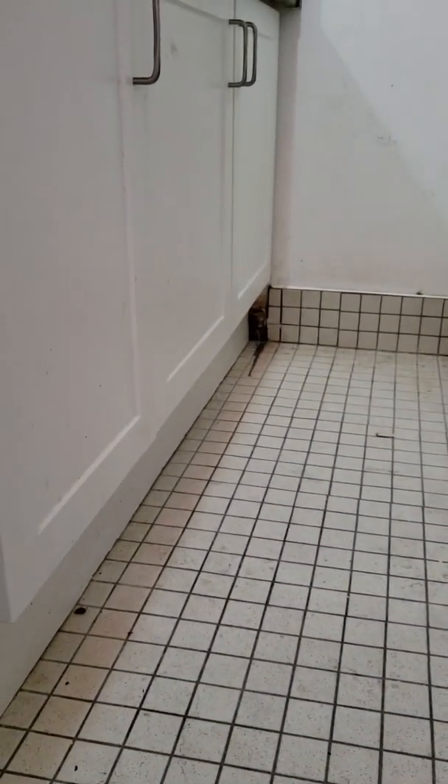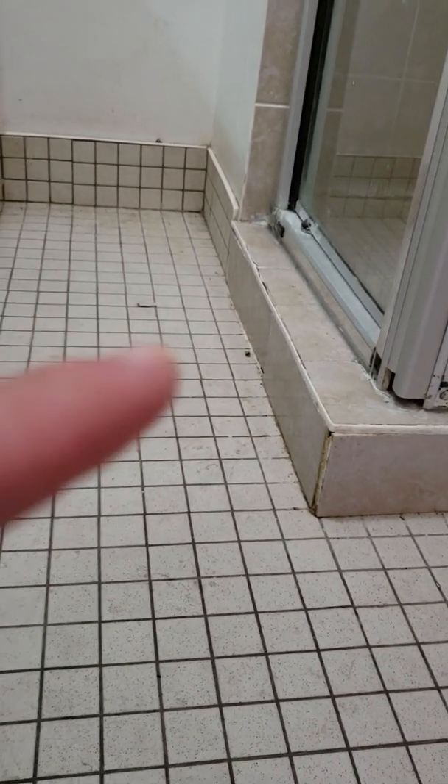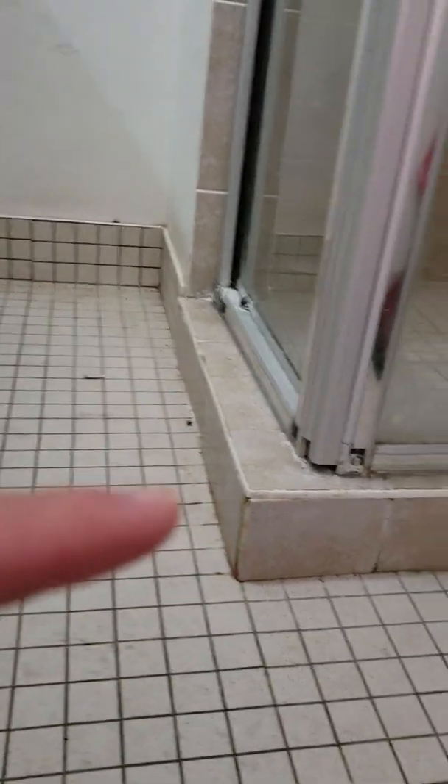We'll have it kind of wrap around to the right at the end where those tiles have fallen off. It looks scary on camera but it's no big deal — it's not mold, it's actually just dirty. We'll put a piece of trim there to clean it up. There are a couple of tiles right here that are literally about to fall off — we could just buy a couple of scraps, cut them to fit, install them, and then re-caulk all the way along.